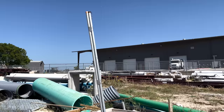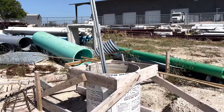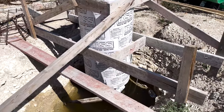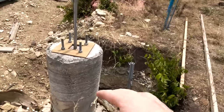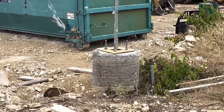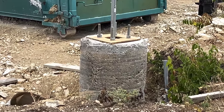Today we actually get to wire up the poles and hang them. Light poles have to be dug in place. Once they get down to depth, they get what are called sono tubes — basically a cardboard tube in place that's going to hold all of the concrete poured in to be the pole base. Pole bases usually stick three to four feet out of the ground, depending on what the site level is. And on top of that, you put the pole.